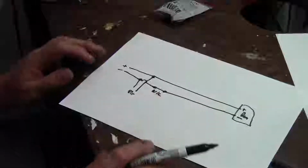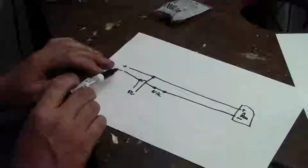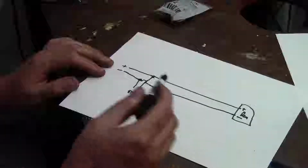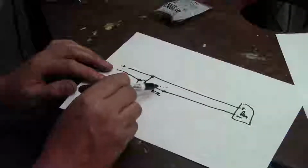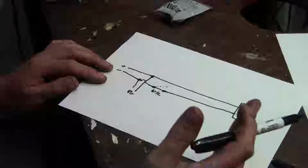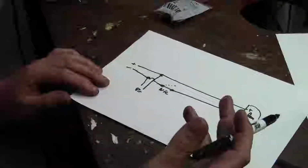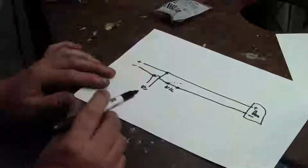So basically, the way this normally closed terminal works means when there is no motion being detected, it's closed and it's powering the transmitter. When there is motion being detected, this little switch or relay opens and the remote transmitter loses power. But that's the wrong way to actually do it, for this type of setup, just a quick and easy remote link to a tool shed.